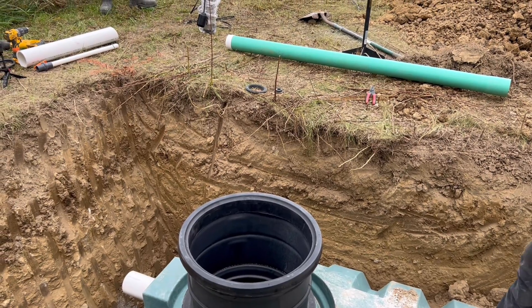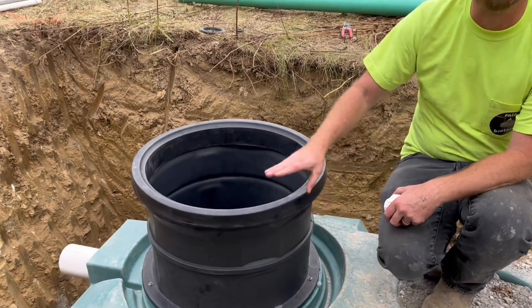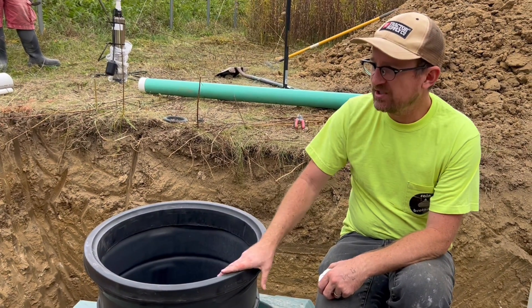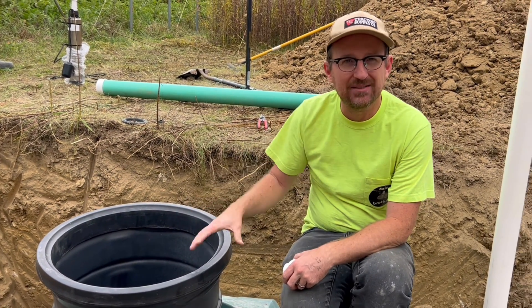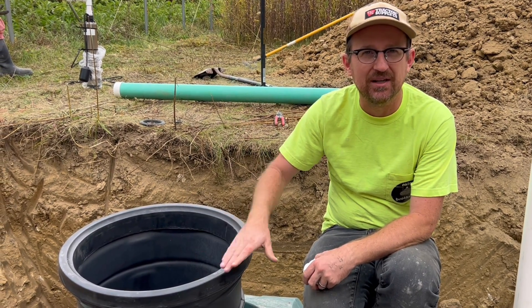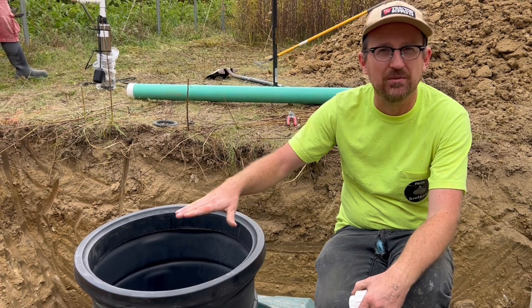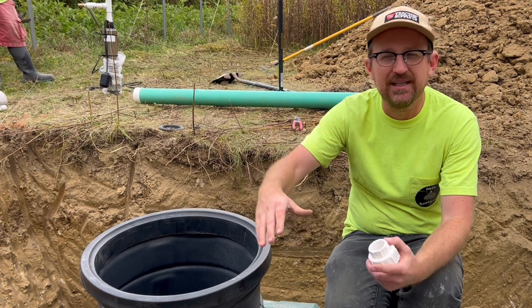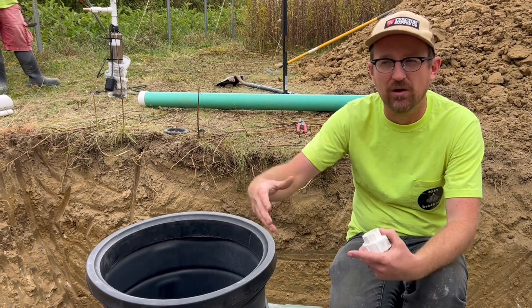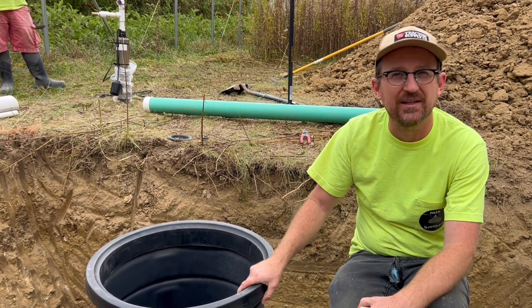So that lid will remain underground — buried. But this side over here will extend above grade. In most applications, we recommend this riser be anywhere from three to eight inches above grade. In this application, there's going to be another high tunnel over this, so that extension above grade is not necessary because it will be sheltered. But generally speaking, you want this riser to be a few inches above grade to keep out any potential groundwater accumulation and to protect the quality of the water inside the tank.